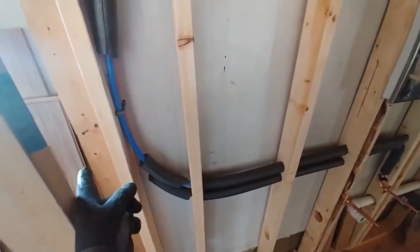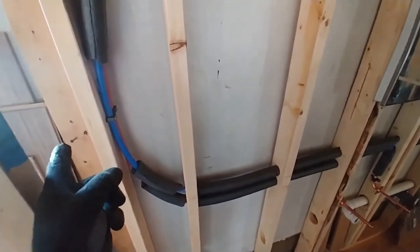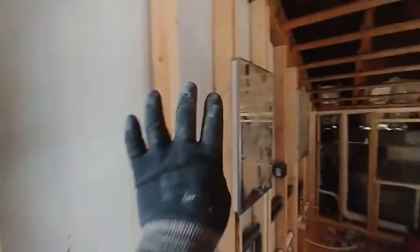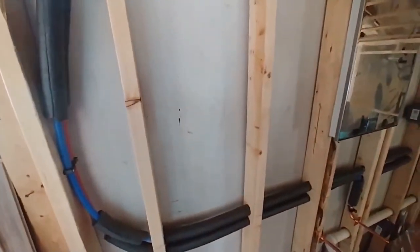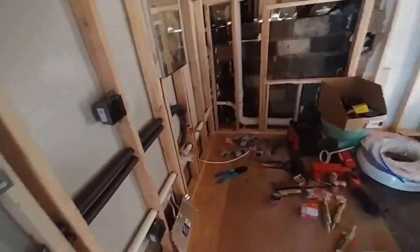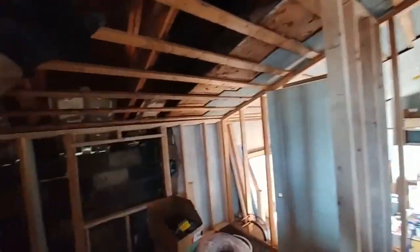There'll be a double gang, you know, there'll be a fan exhaust and humidity exhaust fan and light system on the first switch, and then there's some sconces. I think it's 1, 2, 3, 4 vintage sconces on the wall. They'll be tiled in, and they'll be on the next switch or what have you. So there'll be two different switch circuits in here, but probably no more outlets that I can think of. You don't want to be able to reach anything from the shower, and I think that fan light will be over your head here. There'll be some ceiling lights, can lights or LED discs or whatever like that.